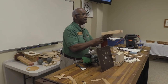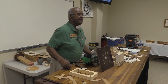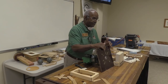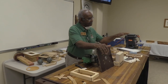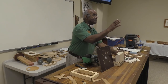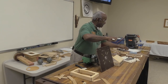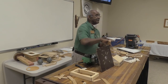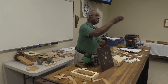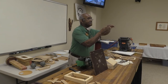When we talk about flocking next week, it'll cover up a lot of things and nobody will know. How smooth does this have to be before flocking? It doesn't have to be perfect, but you don't want ridges. When you put your mastic on for flocking, you don't want to put it on something that's smooth like a finish — you need to run sandpaper over it just a little bit to get some roughness so the mastic will bond. To get rid of ridges, put wood filler inside, let it dry, then sand. Some people fill the bottom corners with glue so they're rounded — I like corners to be as crisp as possible; it looks better.